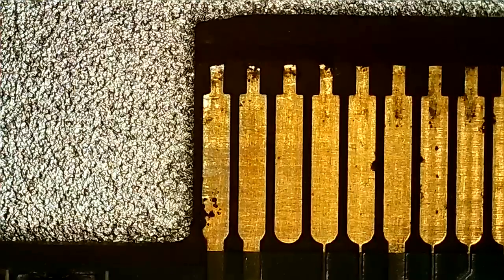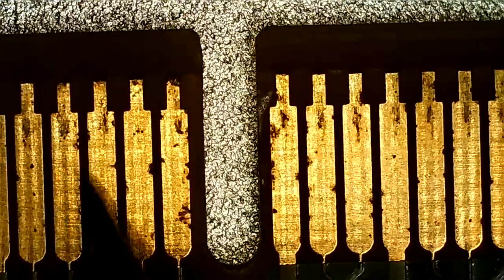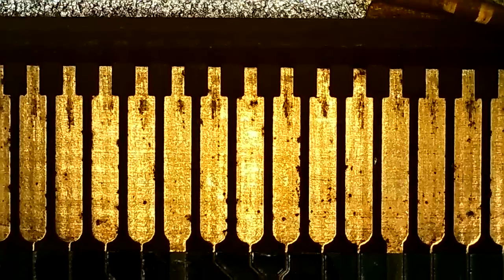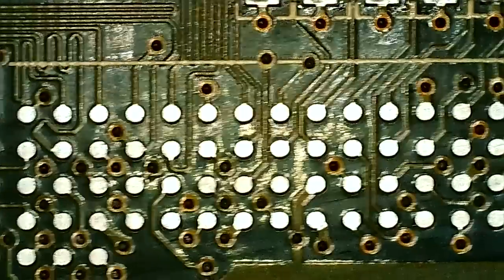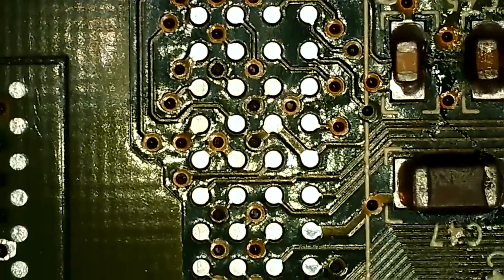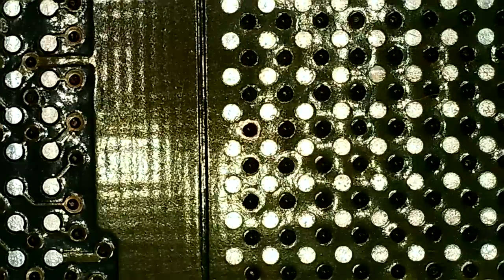So we're gonna have a look at the PCB. So PCI slot up here. Looks like some corrosion on the pads there to the left. Actually a lot of corrosion maybe. Pitting. I have to look into that later, make sure that these pads are actually good, all of them. We don't need to repair, so there's nothing broken along here. Anyways, so we can start looking at the pads here. Make sure they're all there. So that's the outer circumference.